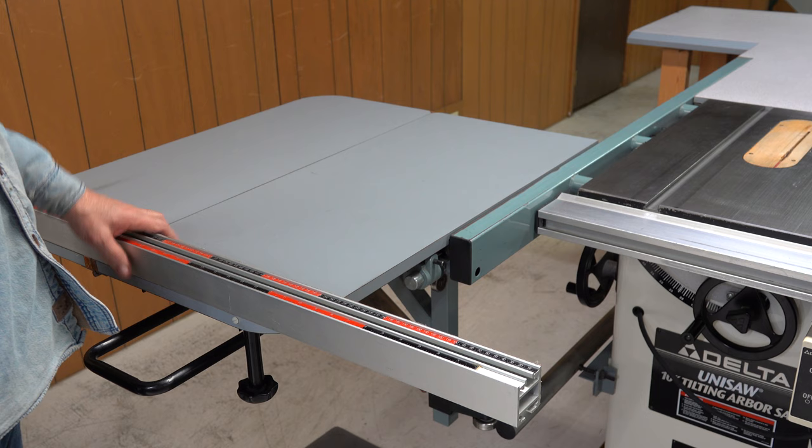Just a thought. For number 53, way down in the bottom, the silver thing you see is the dust collection port. If you reach your hand in there very carefully, because there's a lot of screws on the inside that are sharp, you might find there's a bunch of pieces of wood and things in there blocking and obstructing vacuum.